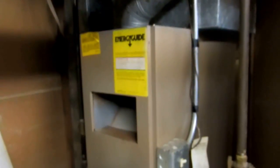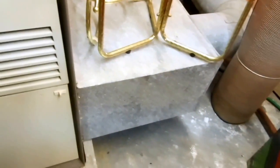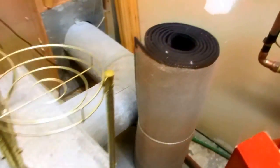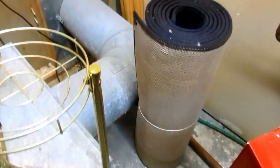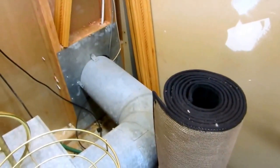Alright, a little better - I turned a light on. A little GE gas furnace, gas fired furnace. There's also what looks like a Magic Chef furnace over there. This one's got an A coil and a little expansion valve in there. I'm going to check the charge. I just checked the filter - we're good with it. That return is only about a 10 or 12 inch. We'll check it.